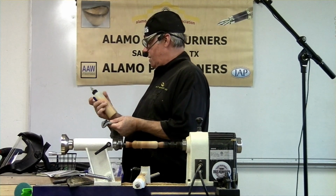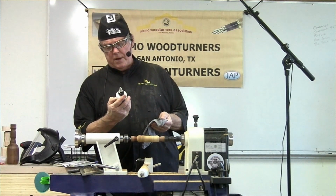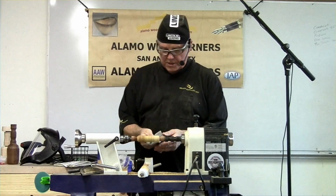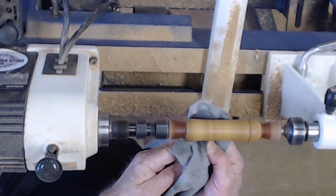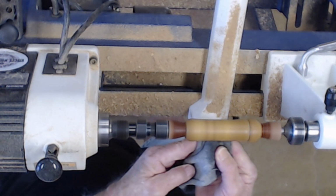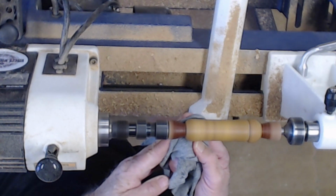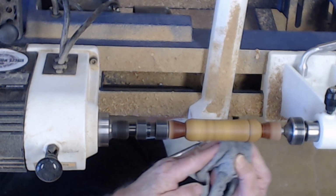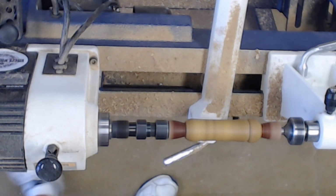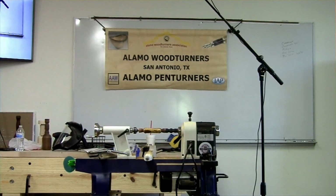This is one third plain clear shellac, or 3 ounces, 3 ounces of boiled linseed oil and 3 ounces of DNA, denatured alcohol. And you can put on as many coats as you want. You can start off with this stuff, put as many coats as you want. Then if you want to put a shiny coat on it, because this stuff will come out a satin color. If you leave it in a squeeze bottle, after a while it separates, just shake it up.